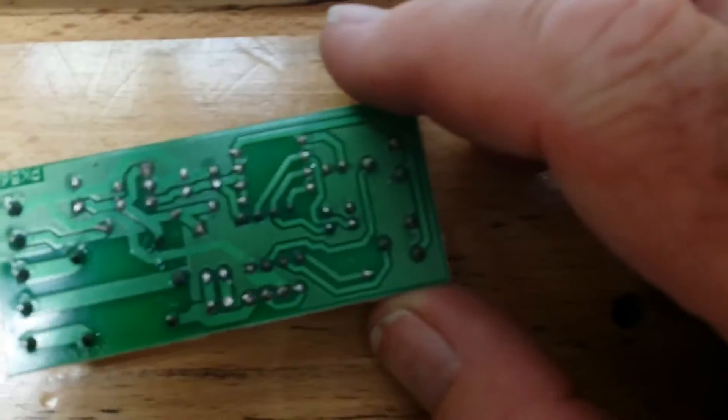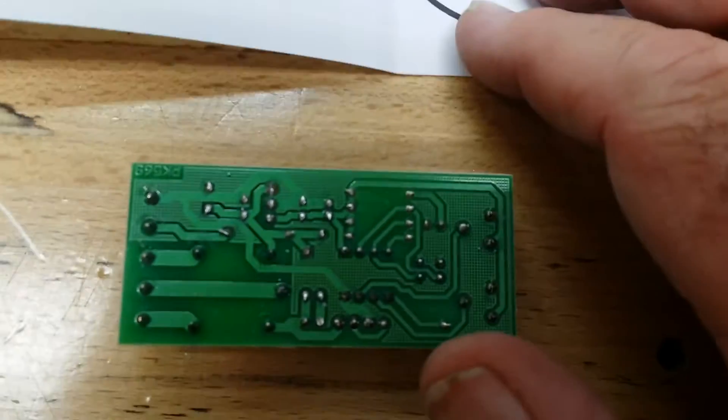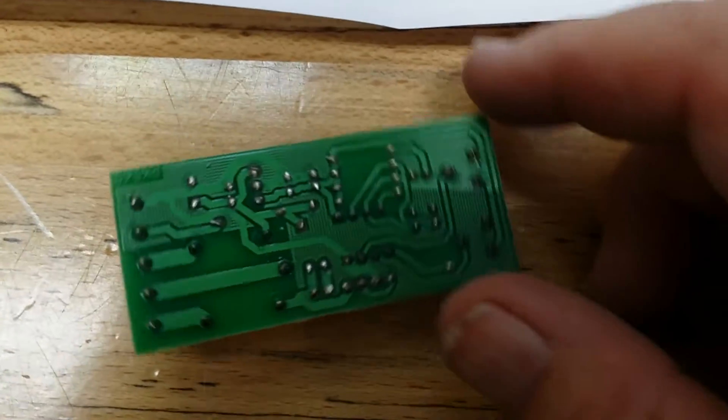On mine — the one I built, this is my spare — when I was done I went ahead and taped the bottom with electrical tape, because I don't want any of those connections exposed since there's 110 volts behind the relay.